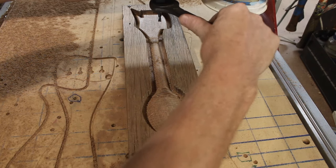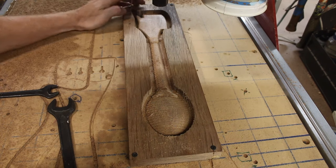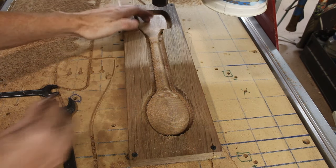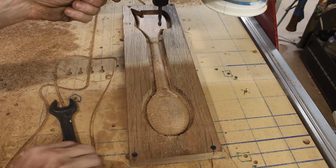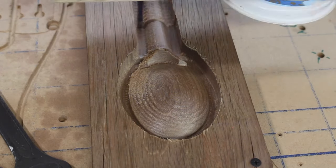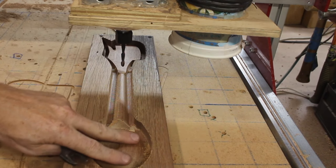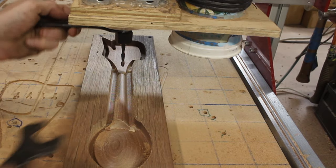I went through and cleaned up my CNC files a little bit and I'm cutting another one. I made it a lot thicker, added a tab up here to make it safer and a tab down here — I might have gone a little too thick, we'll see. This file is going much better; the finish is better because it wasn't chattering around. I have these stronger tabs, so now I'm going to cut my profile tool path.